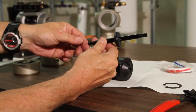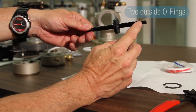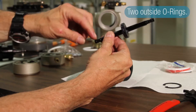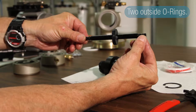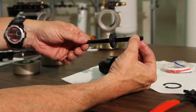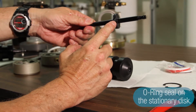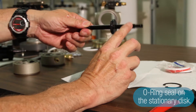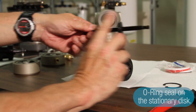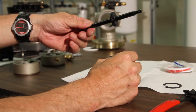Now, the main O-rings on this stationary disc are the two outside O-rings on either side of the shuttle shaft, and they're the critical ones. They're what keep tower pressure from bleeding back into the control air system. And then there's an O-ring seal on the stationary disc, and that's to keep control air pressure from bleeding from one side to the other side of the actual air cylinder, the shuttle itself.